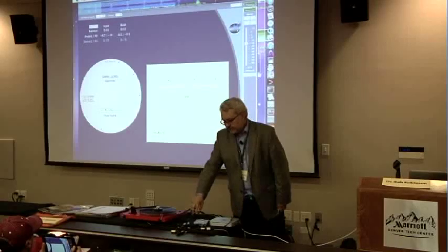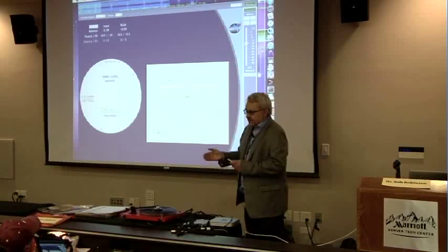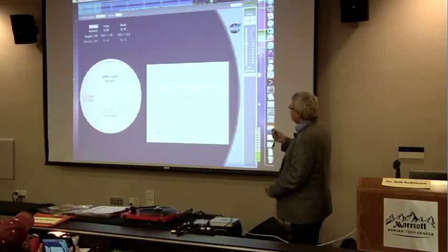You don't have to preview the levels on the entire disc to do the recording. You just sample a really loudly recorded disc, and then you set your input levels using the control panel that comes with these devices, and then you just forget about it. If you encounter another LP that has less hot modulation levels, it doesn't matter, because the dynamic range is going to be constrained by that anyways, even if you only come up to about -16. This is a really cool feature and really an advantage of doing it this way. The other reason it's an advantage is that we have a built-in adjustable rumble filter.